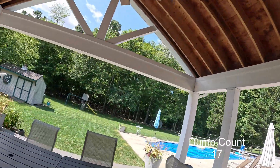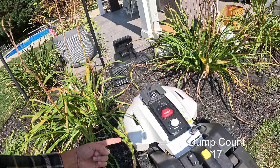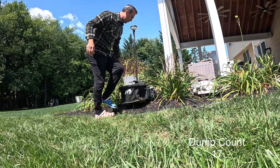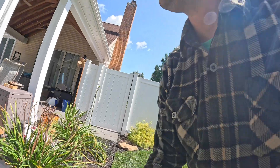It's the morning — the mower was cutting overnight, but I got a notification it ran out of battery. I came out and found it stuck on a hill. It got high-sided with the mulch higher than the wheel, so it just spun the wheels and ran out of battery. You're not supposed to put this on a hill — that's my fault. That's the second issue I've had, both user-initiated: first was the grass too long binding the sweeper, second was placing it on a hill where it got high-sided.